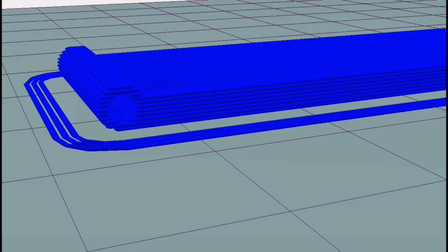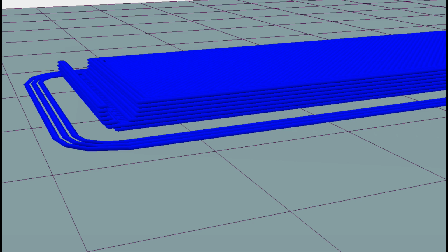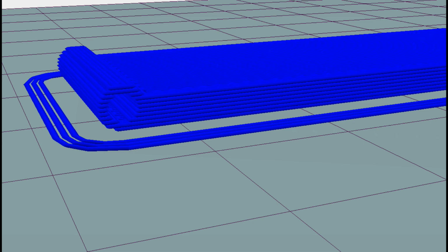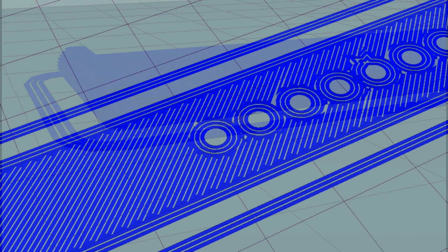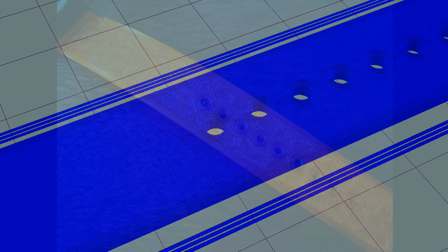This hole is oversized by 2x to accommodate the fact that the hole tends to collapse when you 3D print it in flexible filament. 2 top, 2 bottom layers and a honeycomb hexagonal infill.